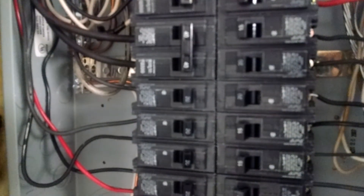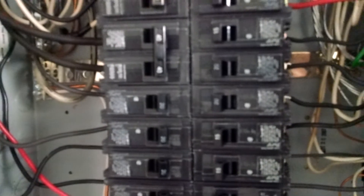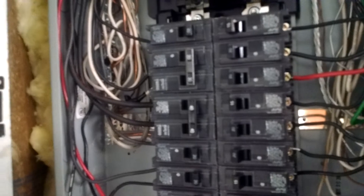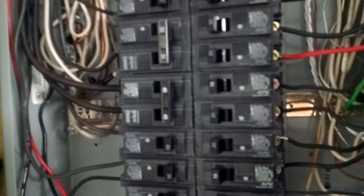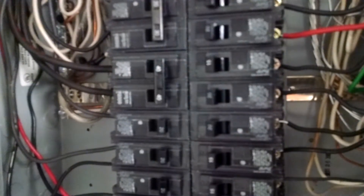What you need to know is that aluminum contracts and expands, and when it does that it has a tendency to overheat and make the connection loose. When the connection gets loose, it creates a fire hazard because it starts sparking. If you ever have an outlet that feels hot to the touch and you have aluminum wiring, this is where you need to take care of it.